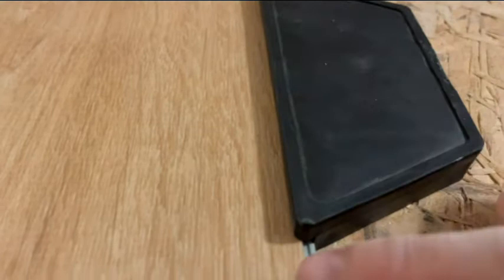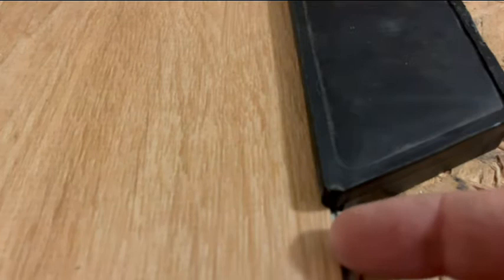I'm gonna pick it up just a little bit. Get the floor up just a little bit. Just set it in there. So notice what we have now. There we go. So now when you hammer on here, the force is not touching this. Your force is hitting this upper plank and then the plank below it. Makes sense, right? So then you can use a regular hammer.